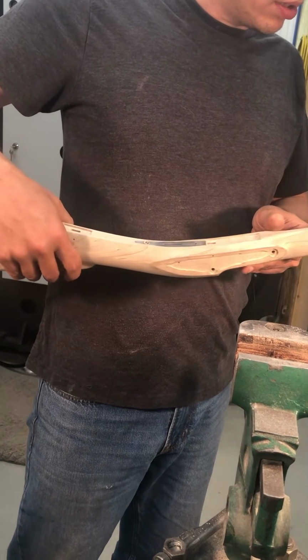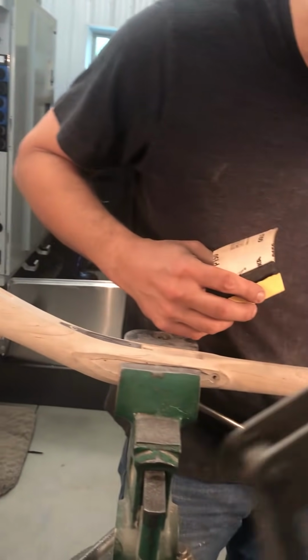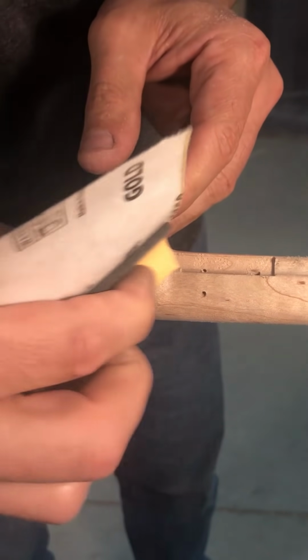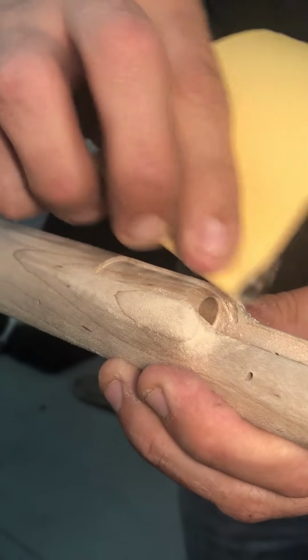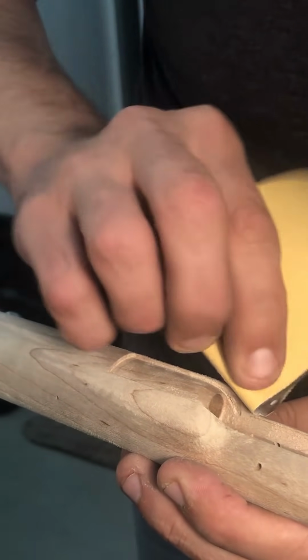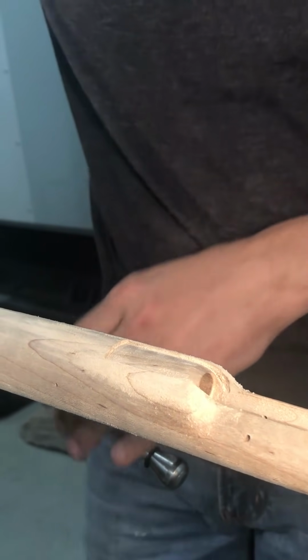I think we've sanded most of the areas that need to be flush with the hardware. One area that I will adjust a little more is at the entry pipe. We filed it pretty much flush, but where it transitions down over the hump of the forestock, we'll work that area down a little bit. I could do it with a file, but if I hold the sandpaper tight, I can do it too. The whole idea is you just want the wood to be even with the metal parts, not above. That's really all there is to it.